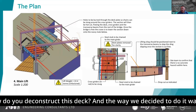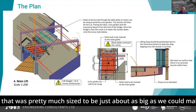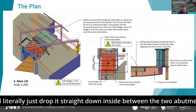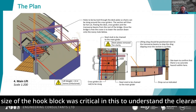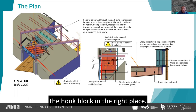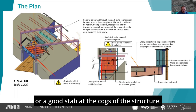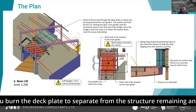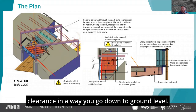The way we decided to do it was to take it out in five lifts, including the two edge girders. The first was to drop the central section — sized to be just about as big as we could make it — and literally drop it straight down inside between the two abutments onto the road level where it could be processed. We modelled it all in 3D, including the lifting gear arrangement and hook block. The hook block size was critical to understand clearances to the OLE — there's not a great deal of clearance. We had to be certain where the COG was to get the hook block in the right place. The principle was to burn the deck plate to separate it from the remaining structure, then do drop cuts to allow more clearance as the bridge is lowered down to ground level.